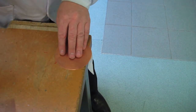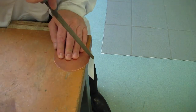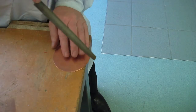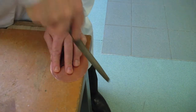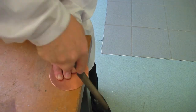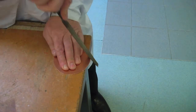A simple trick here: just set the sheet over the edge of the bench and use a file, filing on the way down only. You don't need a vise and you're not putting any marks on the surface of the metal — just work your way around. Because the piece will be fairly distorted by the time we've finished, a perfect circle isn't really necessary, as long as there are no flat sides on it.